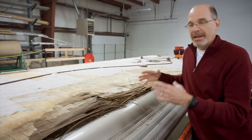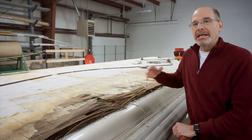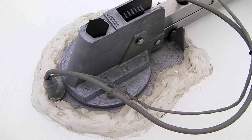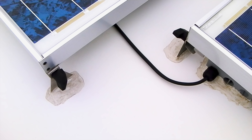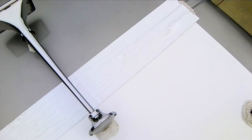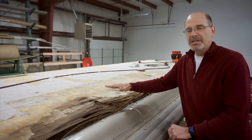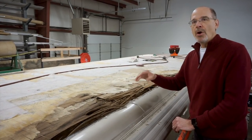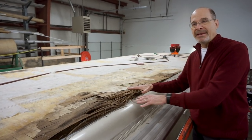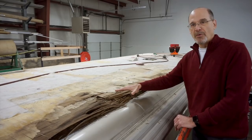We've mentioned before that we get up on the roof on a regular basis and check the DICOR, looking for anywhere that water could penetrate. Look around at antennas, solar panel mounts, the ladder, horns — anything you have up on the roof that isn't solid surface. Anywhere you might have water penetrate. We're looking at the result of allowing that to get out of hand. This is exactly what we want to avoid.